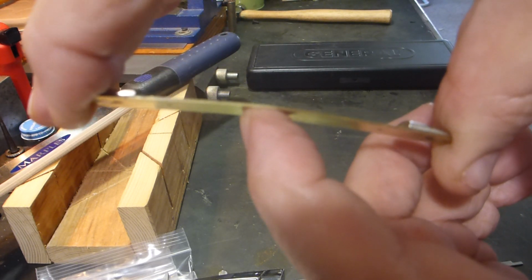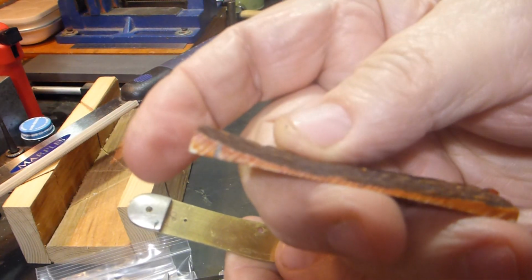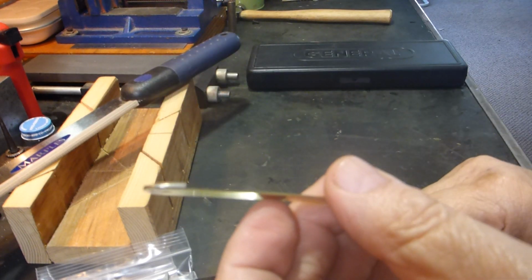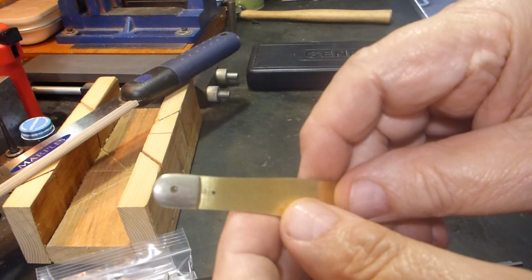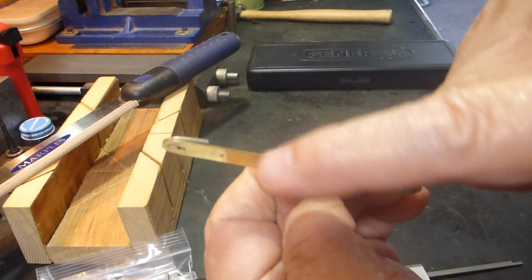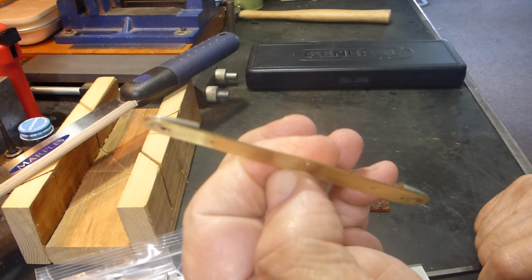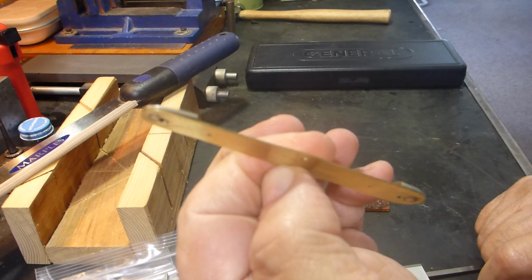And when you put it together, this bone, wood, anything else is really strong in compression this way. You're not really going to move it, especially since it's pinned in 3 places. So rather than sucking it down, you're going to end up with a bowed out place in the center here where the spring should sit flush. So, you know, don't be tempted to get it overly tight.